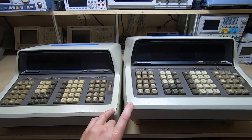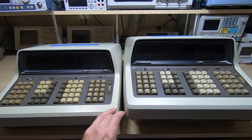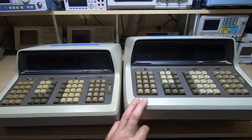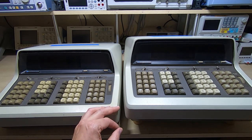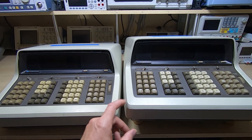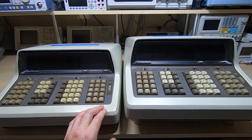Really, it comes down to whether the CRTs are intact. If they've been damaged in shipping it's very difficult to find replacements for them, and that is one of the key failures. If you do have one of these and you're going to ship it, it really needs to be packaged well. It uses electrostatic deflection CRTs, and these particular tubes are fairly prone to internal damage. That damage in turn can lead to other failures within the machine, but we'll come back to that in future videos.